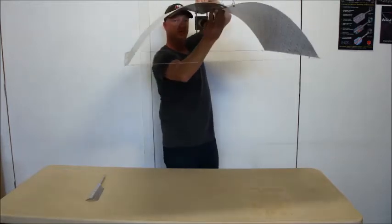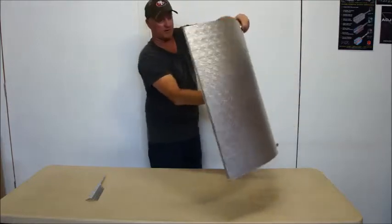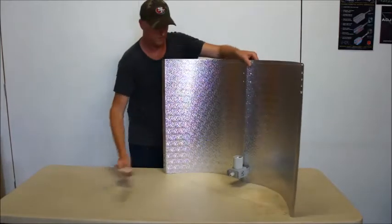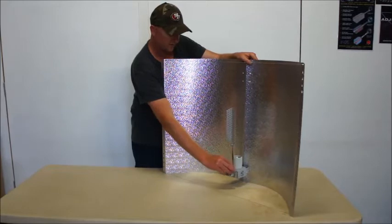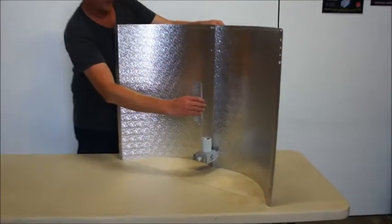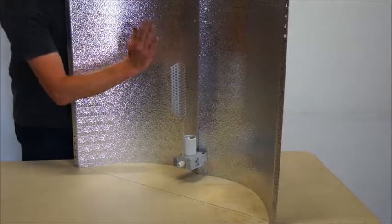This could be done when the wing was in situ or on the ground like so. The super spreader attaches like this, straight into that little slot here. This should be parallel with the lamp in this direction, and also side to side, and square with the arc tube in every direction that's possible.